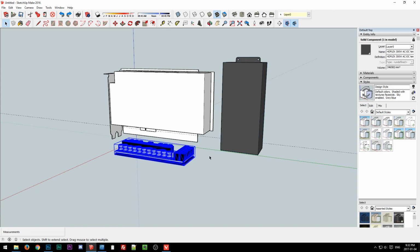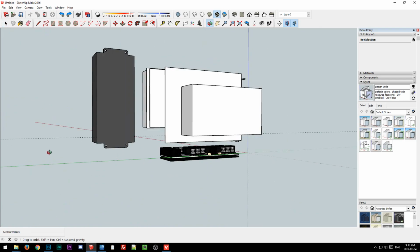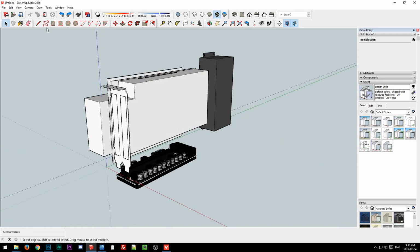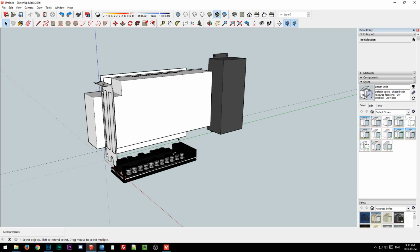Which I guess we're kind of doing the same with the HD Plex, though not quite as bad, because there's the HD Plex 300 watt, and then the G-Unique has one in this type of form factor, so you'd have two different options. That wouldn't be quite as bad. I don't know, it's tough. This is the thing with SFF design in general: you come to crossroads and ask which route to go. You can't just do both routes because then it's bigger, which defeats the purpose. So you have to pick one and optimize to it in order to maximize the space usage within the volume you have.